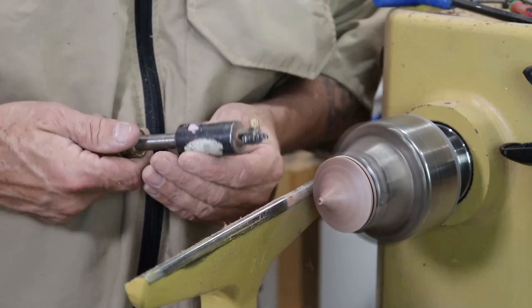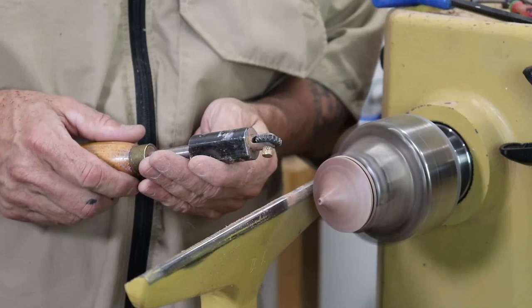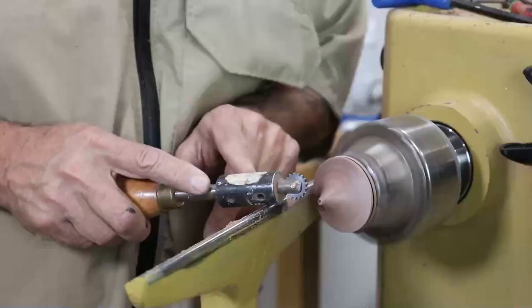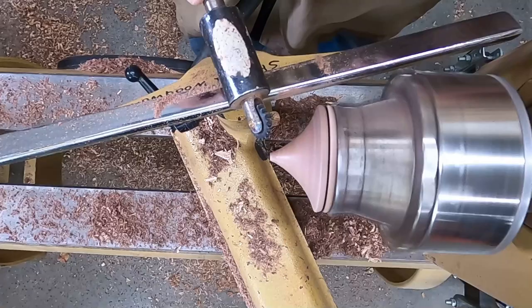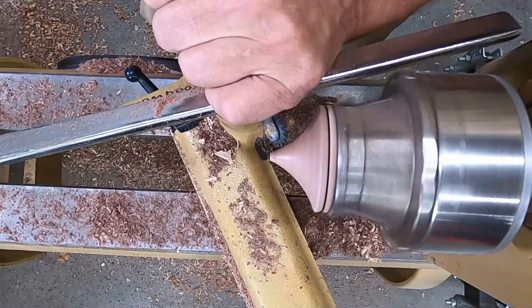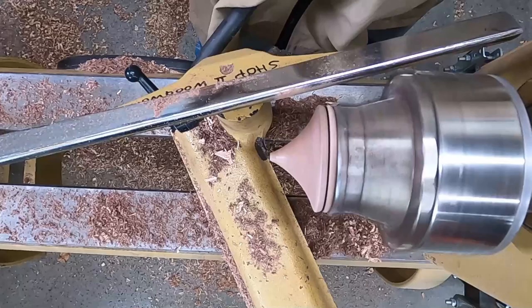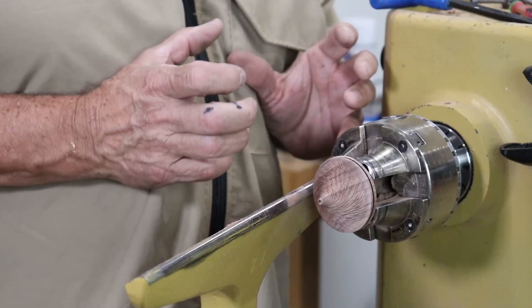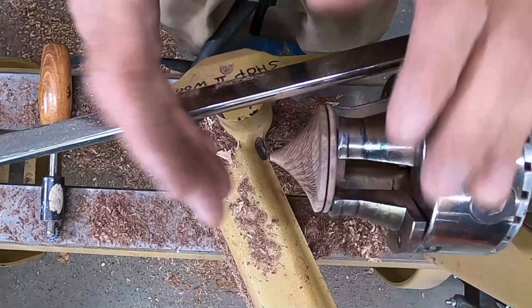I keep cutting it down, taking a little bit off at a time, then come back and skin it over. Then I take a texturing tool — this is from Crown; Sorby makes one too — and it rests flat on the tool rest. I'm not changing the speed. You can change the speed for a different texture pattern, but since we're making so many I just run it through just like that — one little pass and you can see the texture it gives. If you change the speed or angle you get a different texture, but I don't change speeds anymore.